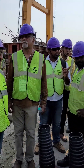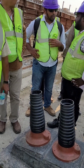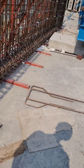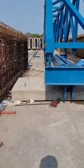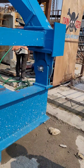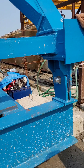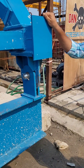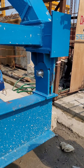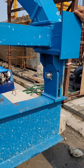After stressing and grouting up all the stages, we have to do the recess filling. What is this? This is a lifting beam — a girder lifting beam. Basically, we are using both the gantries for lifting a single girder. With the help of this strong back, I can lift a girder using basically one single gantry.